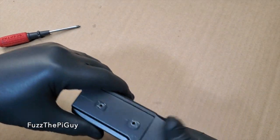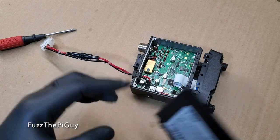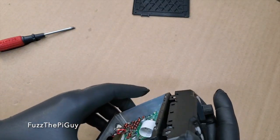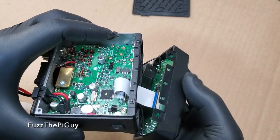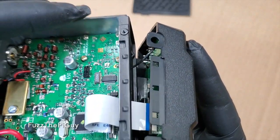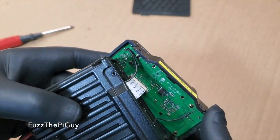Let's see what we can break here. We got the bottom lid made out of plastic, with little grooves on it to make it a little more rugged. We have the screen here — and we have a ribbon cable, kind of like something you'd see on the Raspberry Pi for the camera, if you're familiar with them. And we do have two little pieces of wire there, which makes it a little harder to get the screen detachable. Because you could pop the ribbon cable off, but you'd have to cut or unsolder the wires.